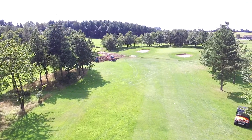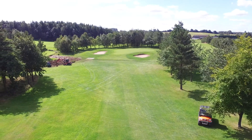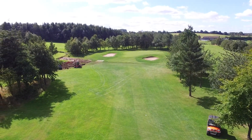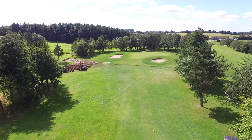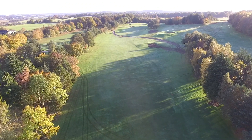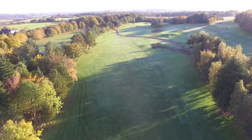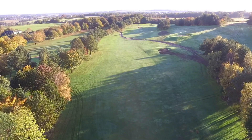As part of our overall master plan we had a topographical survey completed in 2019, and from that all our existing watercourses — mainly the streams, the ditches and the ponds — and also some of the main carrier pipes that are currently under the course have all been plotted, and that's enabled us to make an assessment of the existing drainage out there.